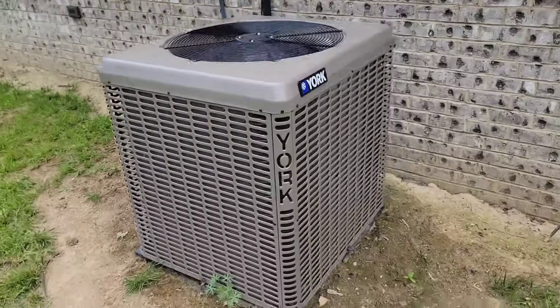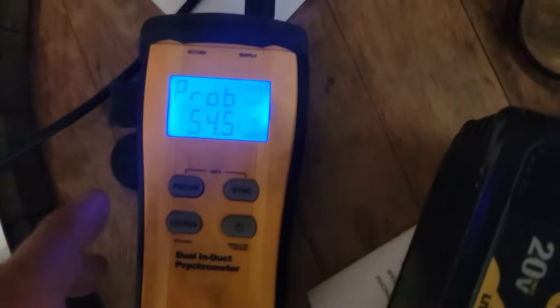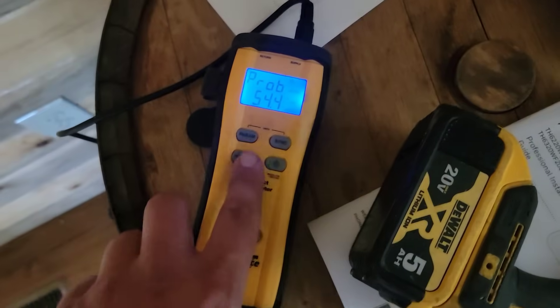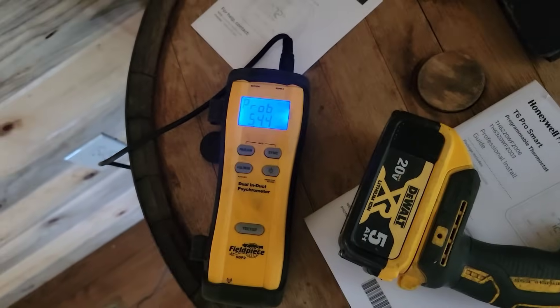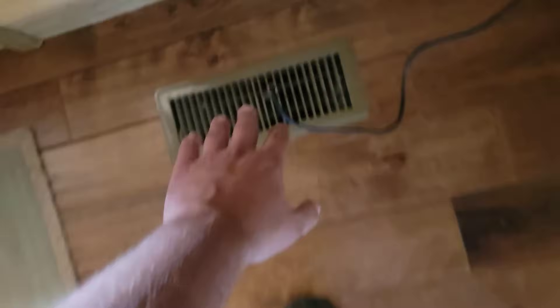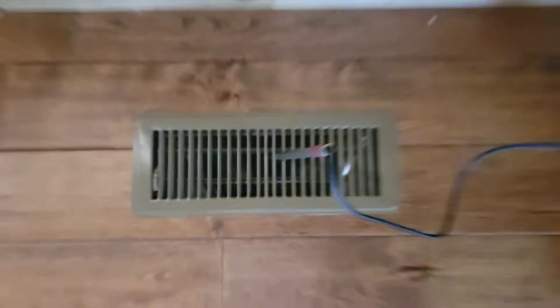Let's go inside. I'm going to show you something important — show you how to make magic. Thermostat is saying room temp is 71. It's 71 degrees in this house. Supply vent is blowing 54 degree air. That's not 20 degrees. So, what I'm going to do is check airflow because I can hear these vents — hear that? They're rocking.